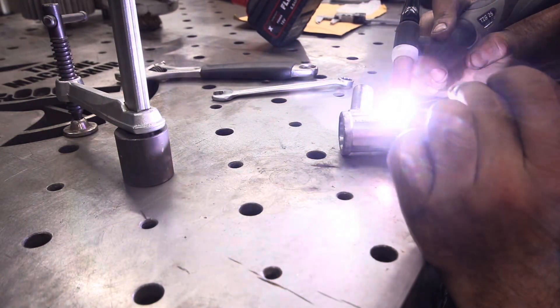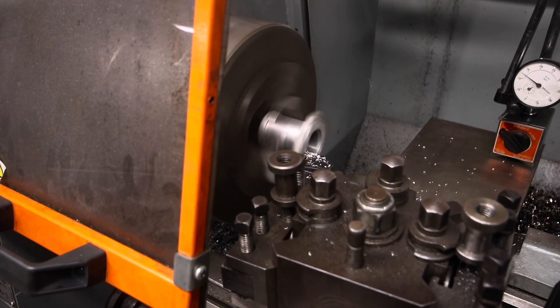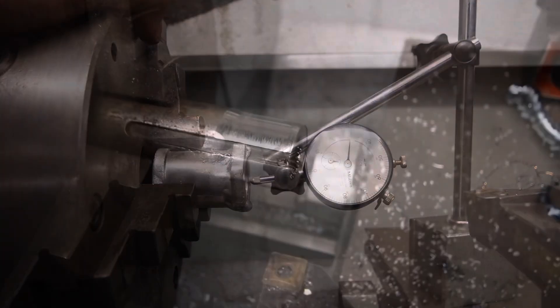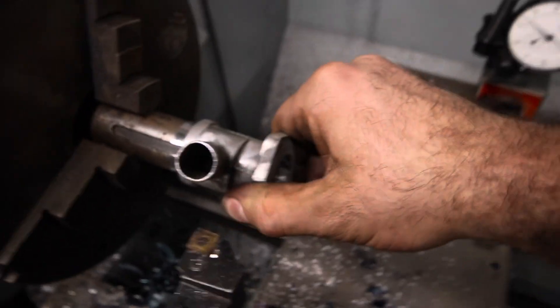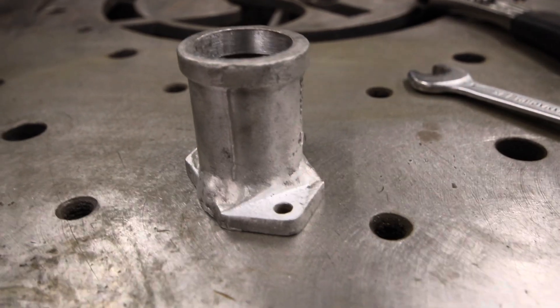In this particular case there's going to be a piston sliding in and out, so any excess weld on the mating surfaces comes off with a lathe to make sure we've got a perfectly flat surface where this bolts to the engine block. Inside the unit you need to make sure it's perfectly smooth with no excess weld — so that's a run-out gauge there, and if you have any little bits of weld on there you need to take those out with a lathe. After much toing and froing we get a perfectly smooth surface and internals. That's the finished piece. Bob has very kindly pressed it back together for us, so a huge thanks to Bob at the machine shop.